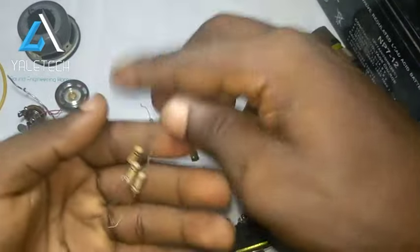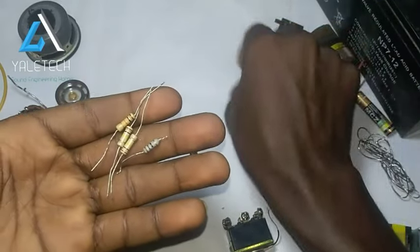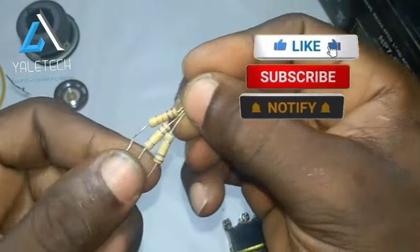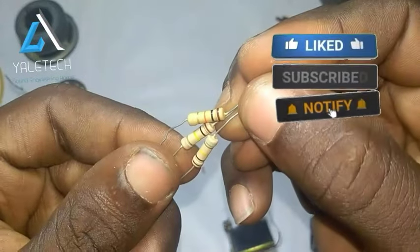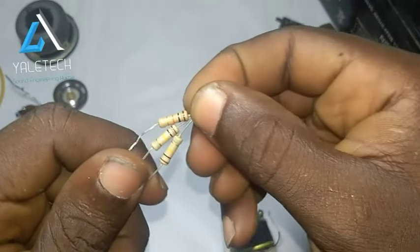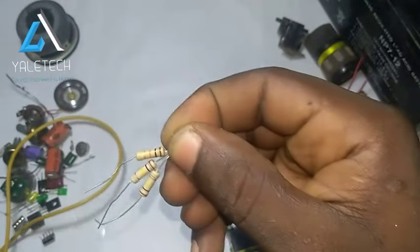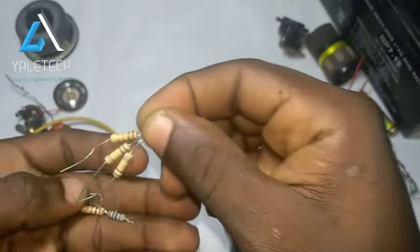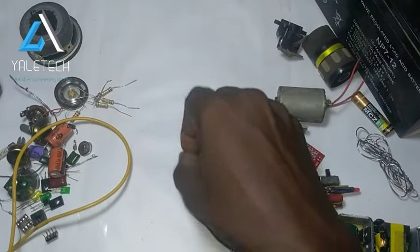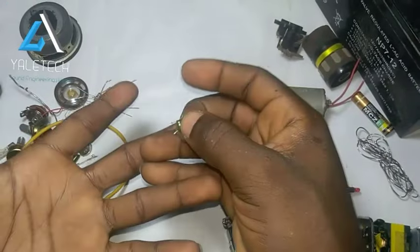The next one we have is what we call resistors. Resistor — from the word 'to resist' — means it resists the flow of current. They are very useful components. If you look at them, their color codes are different. We can identify the value of a resistor to get the resistance level using the color code. At the same time, we can still use our multimeter to get that. Please subscribe to this channel as I'll be dropping different projects over time.